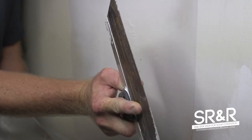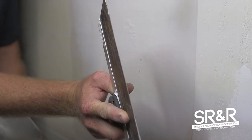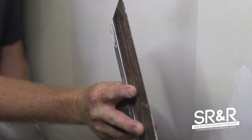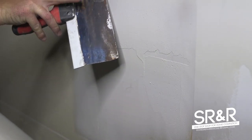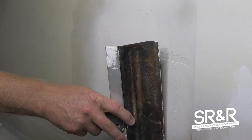If you use one knife pressure or one finger on the knife, it creates middle tension and a V shape in your mud line. If you put two fingers, there's less surface contact so it can go across flat. I clean the edges up by applying pressure to one side of the knife and drawing it over — that means less you have to sand. Then we'll dry that and come back to it.